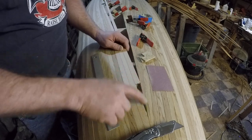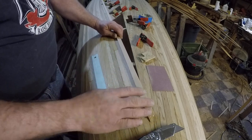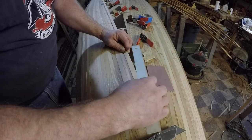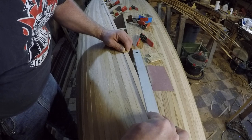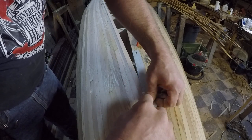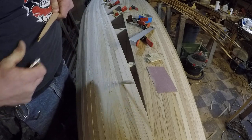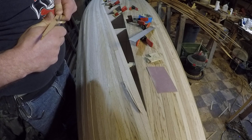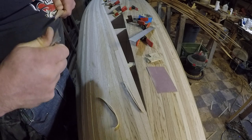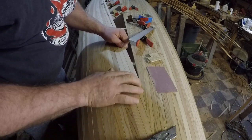The trick is to cut a taper so that the strips fit on the edge at the keel line of the boat where the two halves meet. Start by lining up the strip in the general position where it's going to live, and hold a straight edge down that center line so you can trace the approximate shape. Once that's done, knock off the extra material with a razor. At this point I'm not trying to be super accurate, just close enough to start testing.